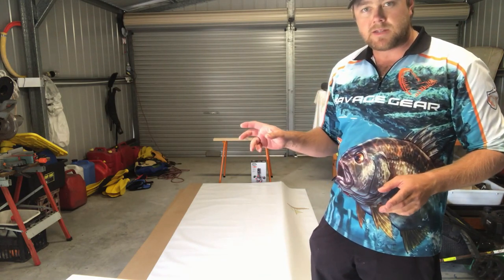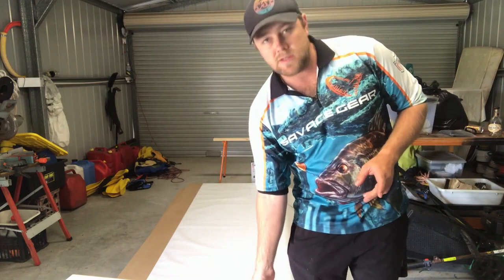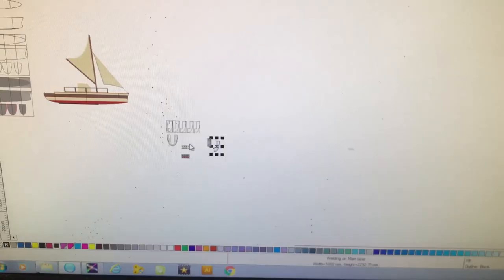The way I've designed this boat is to build it symmetrically front and back, although it's going to have a different nose cone and a different tail on it. That means I only have to build three molds: one half of the center section, then a nose cone mold and a tail mold. The center section will have a flange at the front and back with bolt holes, and then we'll bolt the nose cone on - make two of those - and bolt the tail cone on - make two of those - and join them together to make a 50-plus-foot vaka.